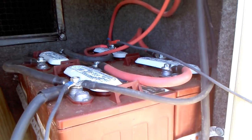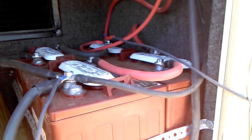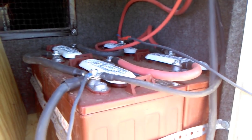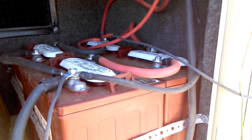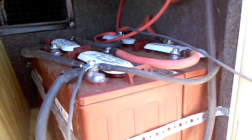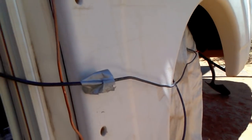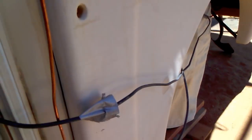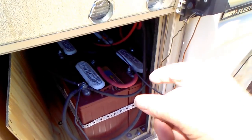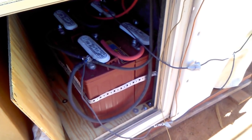I was always asking people — in Arizona, could I have four panels and 20 batteries? They said no problem, you can do it. Well, you could, but the panels would not develop enough juice to charge the batteries. It would trickle-charge all the time and you'd end up burning the batteries out. I hope these cables hooked up to the front two batteries aren't burning them out, but it is what it is. I'm going to order some cables to connect from here to the coach batteries, but I haven't ordered them yet — trying to put a big enough order together to make it worthwhile.